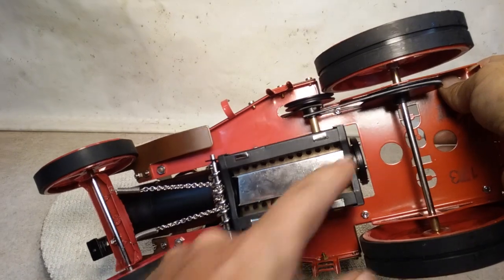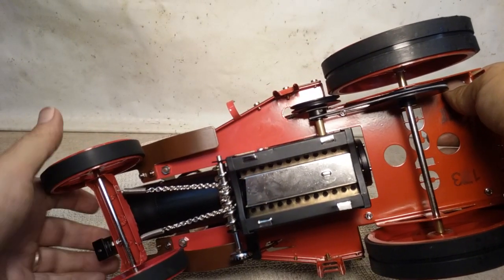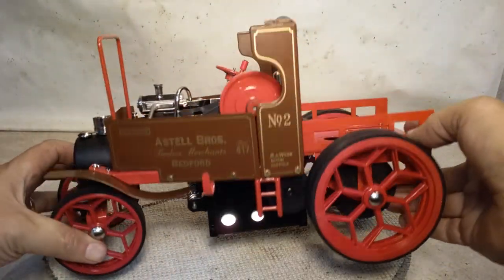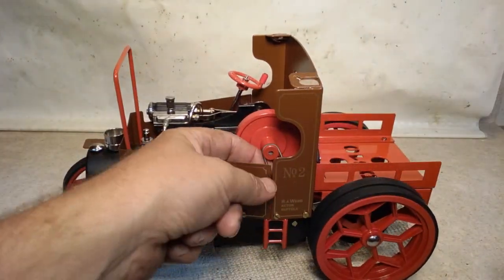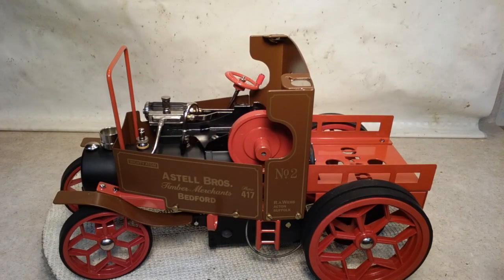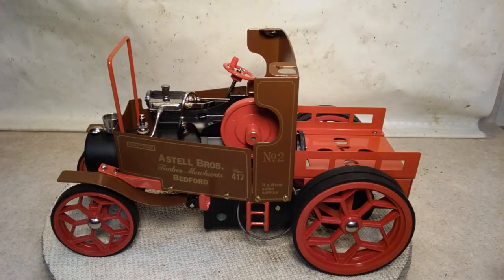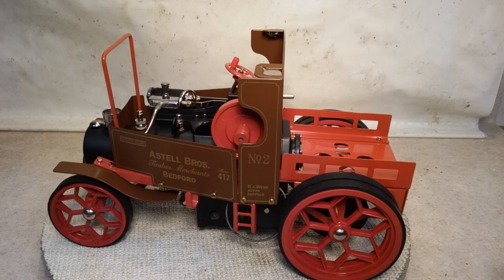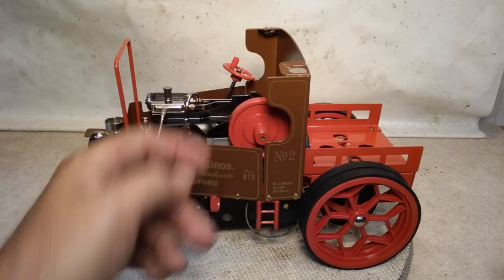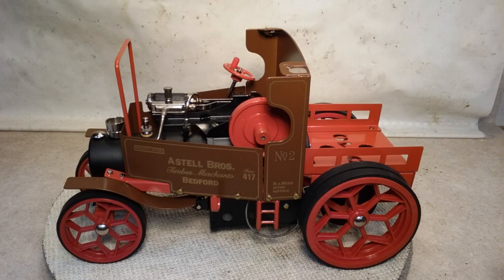These are all nylon, by the way. And then into a final drive of two and a half inches. You're gonna need a needle-nose pliers every time you take this belt on and off. People complain about the slippage of the belt — yeah, there's slippage. It doesn't have the greatest traction. The first time I fired it up I didn't know it was supposed to be moving, because it's direct drive — if that belt's on, it's gonna move. But yeah, there is some slippage to it.